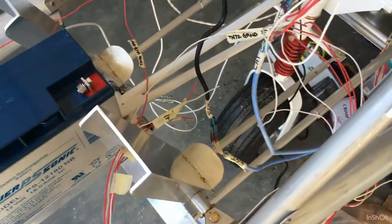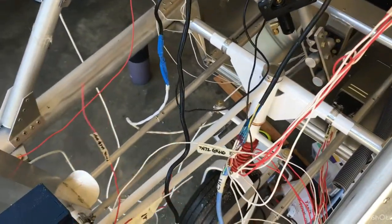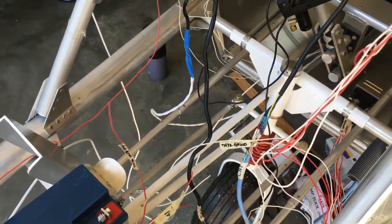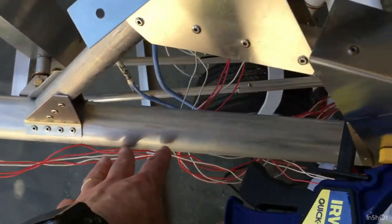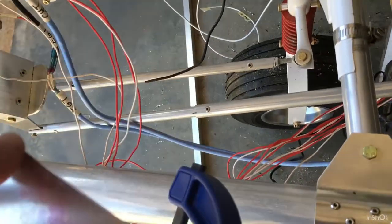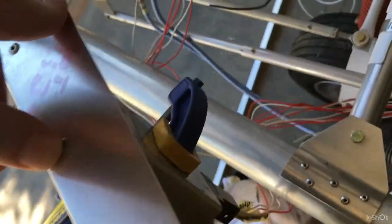Another thing I did was a trial run of the transponder. You can see from the controller the wiring harness that I made. There are some ground and power wires right here, going to go through the circuit breakers. Then this is going to wire around the longeron. I'll tie wrap it off or clamp it, probably tie wrap it. And then it comes into the GPS receiver.